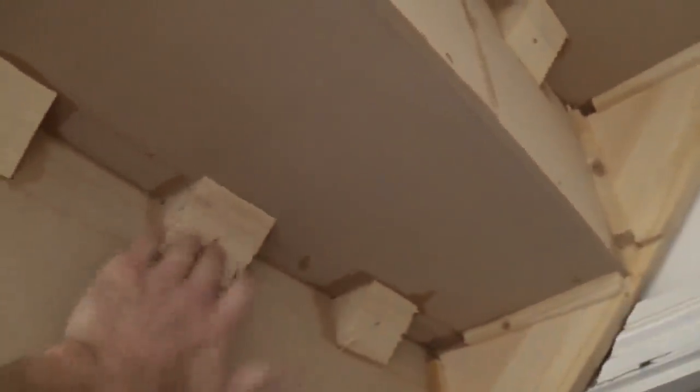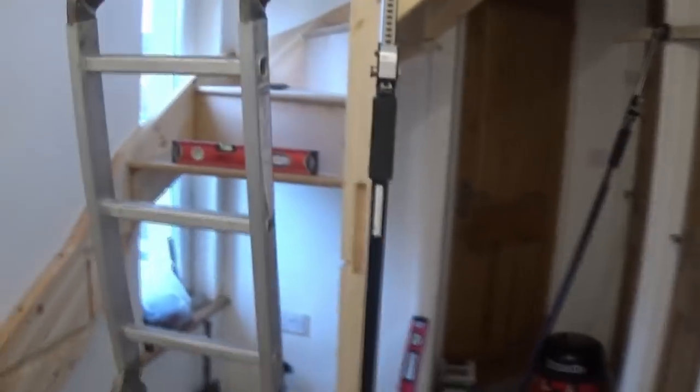Looking from the side of the stairs, you can see we slot these stair treads in place, then push the riser up behind it. We've also got these wedges that come supplied with the kit — you wedge one underneath to hold the tread in place and hold the riser in place. On the corner winder ones, there are two wedges like that. On the pre-assembled section of stairs there are also these blocks — I've got to fit those into place afterwards, once we know everything is levelled up and ready to go.